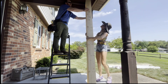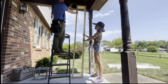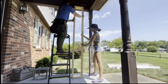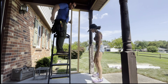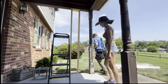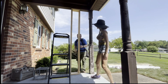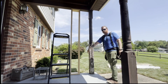Now that we have our support built, we're going to check it fits and that it's supporting what we need. Be aware — this is aluminum capping and there are actually different boards inside: one for support and one just for building out, which would not support anything. That build-out — the bigger one — does not support anything, so don't be fooled. It's the actual header beam inside. We fit it in snug so there's tension that will support the wall once we take the post out, transferring any weight right into the concrete.